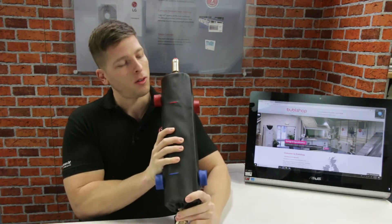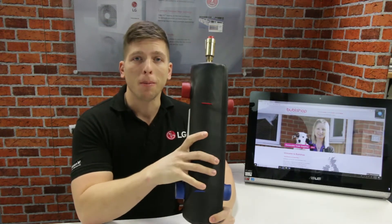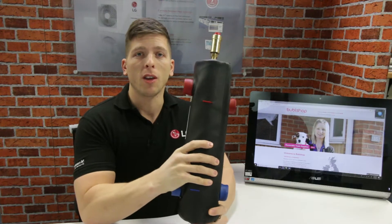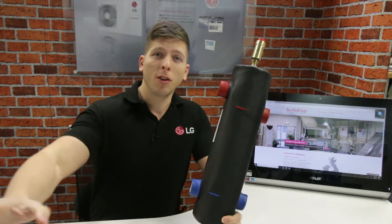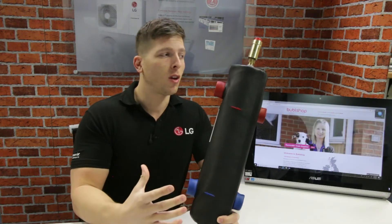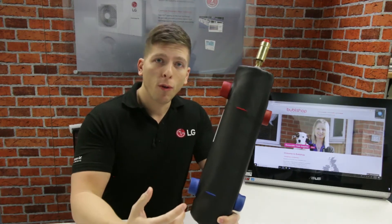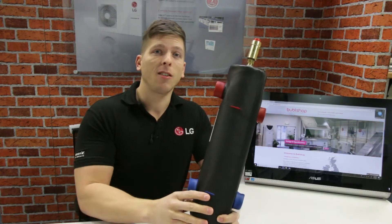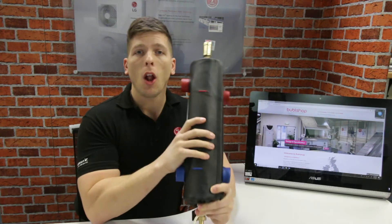Here's one here. Low-loss headers are great at eliminating poor flow issues on heat pumps. The trouble with a heat pump is that when they're creating that initial charge of energy, they just want to disperse it as quickly as possible. And if you've got any restrictions in the system, such as micro-bore or if you're turning down a radiator, that will create poor flow, and in doing so, it'll be negative towards the efficiencies of the heat pump. So to eliminate that — low-loss header.